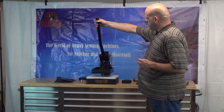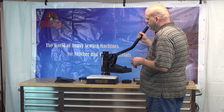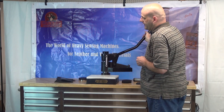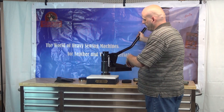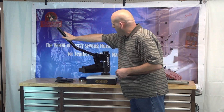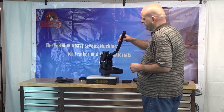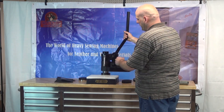This press is rated for approximately four tons of pressure. The convenient thing about the press is that it has a swing-out design so that you can actually swing the head of the press away, much like you can do on larger industrial clickers. The head swings basically 360 degrees almost all the way around, so you can move the head out of the way if you're cutting different sizes of die stock or if you need to position the leather onto the press.